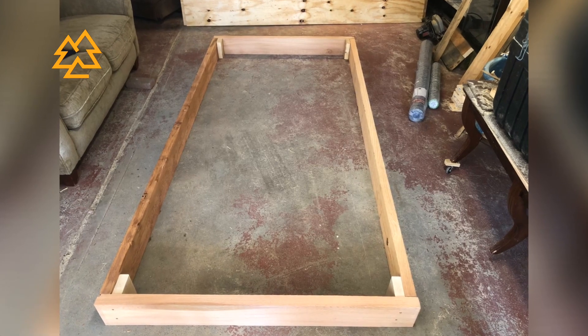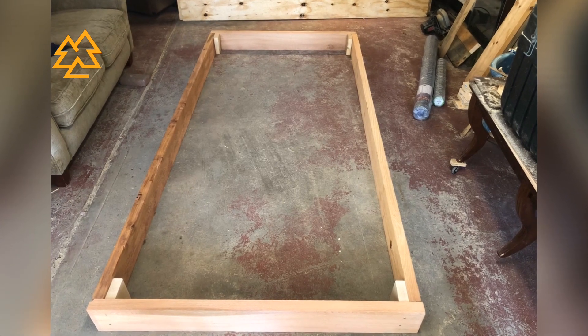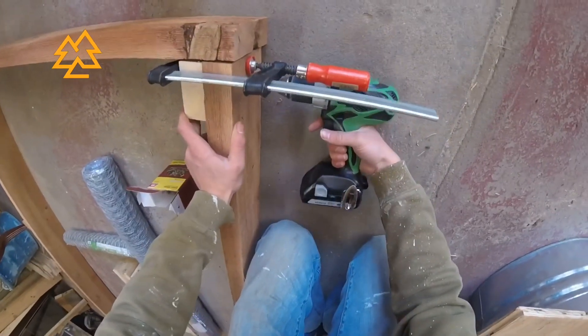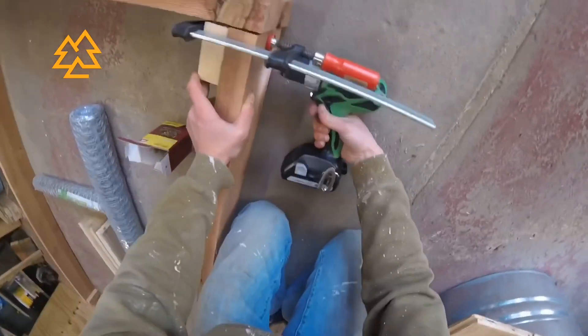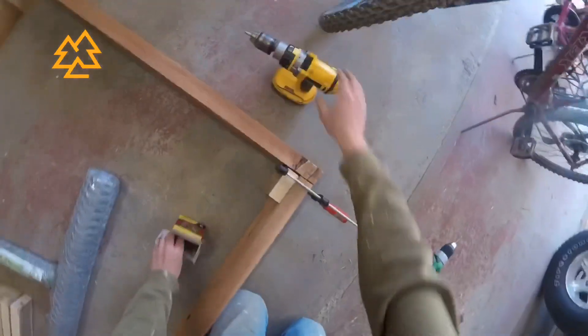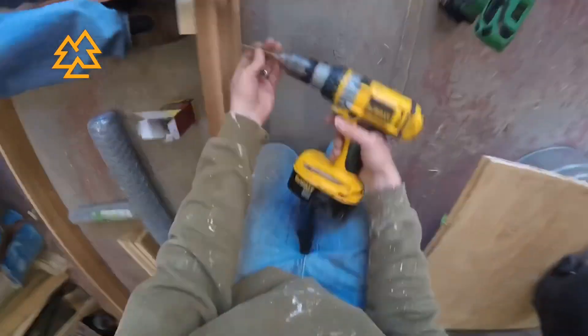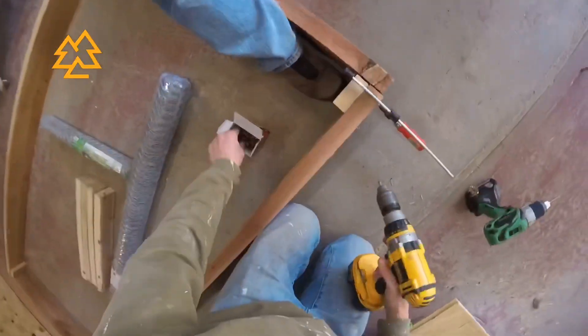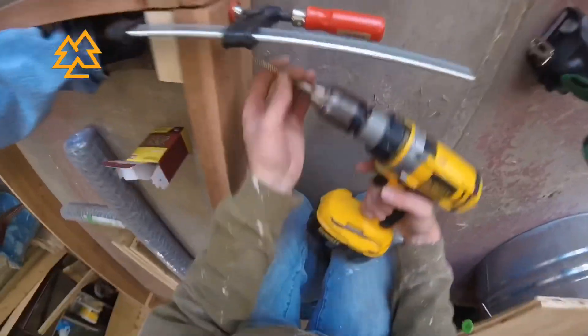To start, we're going to lay the wood in this configuration with the six-inch two-by-fours in each corner. I put two screws through each two-by-six into the two-by-four. I pre-drilled the holes first and then used a Bessey clamp to keep the two-by-four flush against the two-by-six while putting the screws in, and then repeated this for all four corners. After this, the bottom frame is all done.